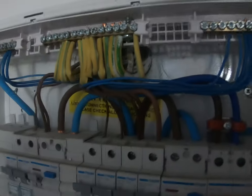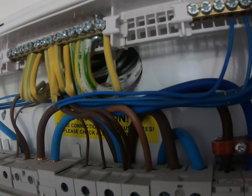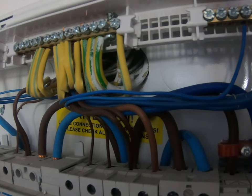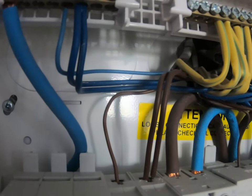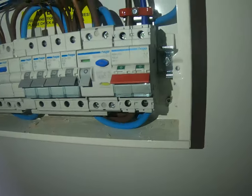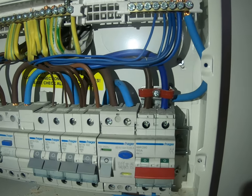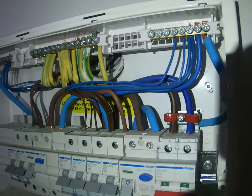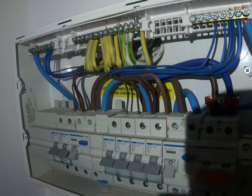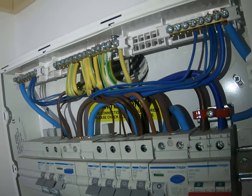I'm not sure I like the fact that they've not used grommet strip where the cables enter — you can see a cable rubbing across the metal enclosure. This time it's an earth wire that's rubbed against it so there are no live conductors rubbed against it, so I'm not too worried. Not great though — I'd have liked to have seen some grommet strip. Another potential concern is the 16mm twin-and-CPC cable coming into the property. It's not protected by a 30mA RCD and goes inside a wall; it could be buried at a depth greater than 50mm which would comply, but I can't verify the depth so that'll be marked as a limitation.